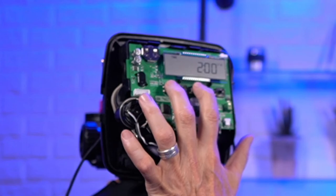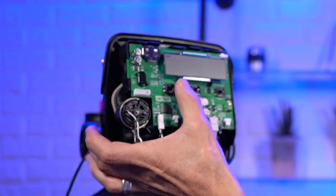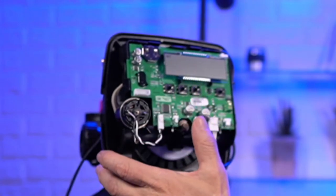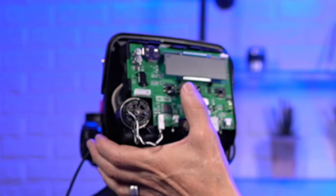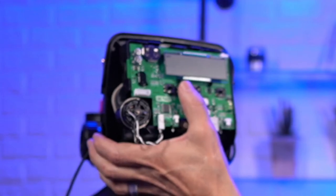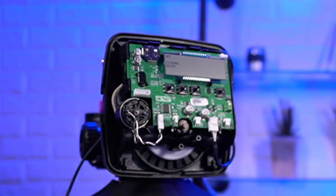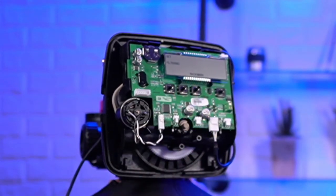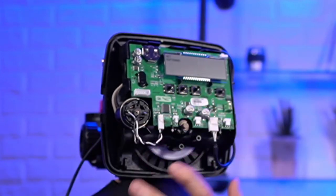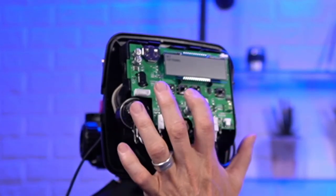Next and down together. Okay, so you would change it to either softening, regen, so they give you three different settings here. Softening, regenerate, that would be basically an air over media type system, an iron filter like we talked about earlier. Or if you're going to use it as a backwashing filter, you set it for this one. So a little bit different configuration. You end up in the same spot, but you go through a few different steps.